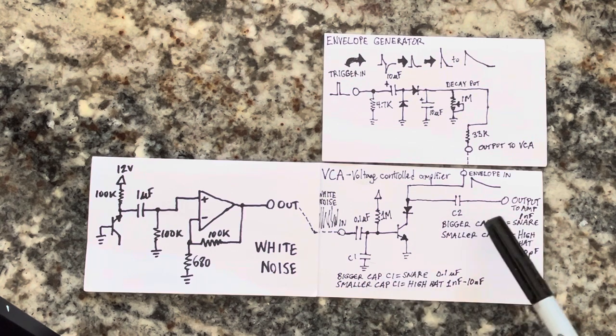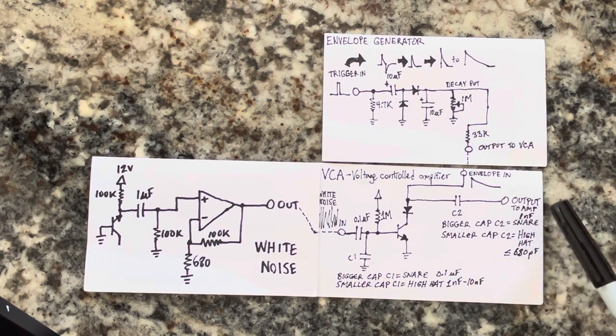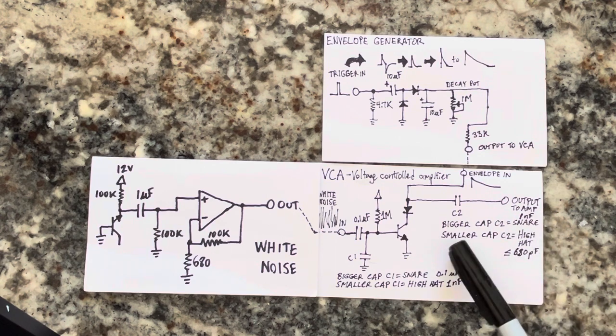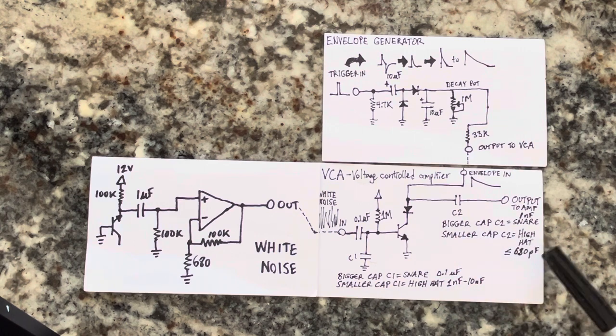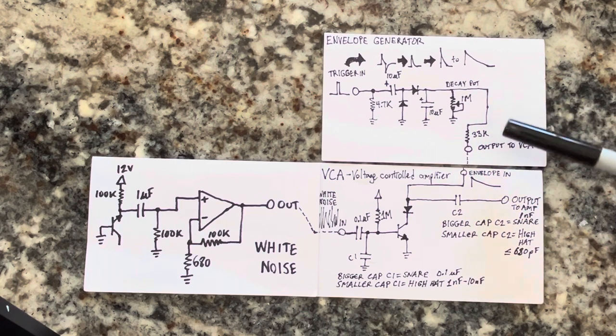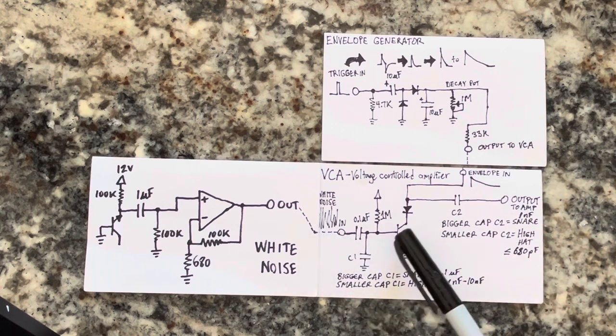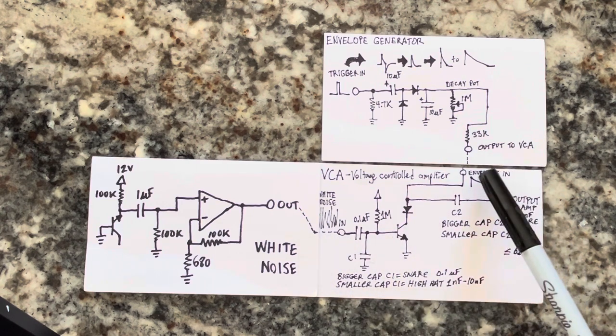The larger the cap, the more bassy sounds come through, and so that produces a snare drum type of effect. If you make it 1 nanofarad, if you put a smaller cap in, like 680 picofarad, it will give you a more hi-hat type sound, a higher frequency will go through. And so that envelope controls the voltage controlled amplifier, and the signal gets amplified based on the amount of voltage